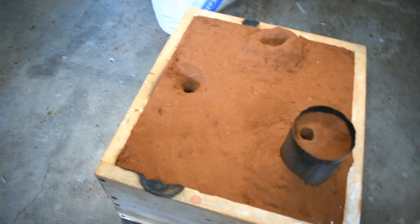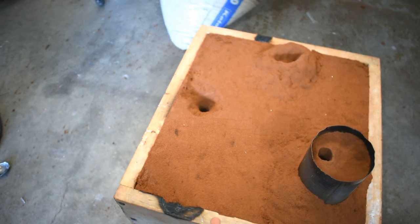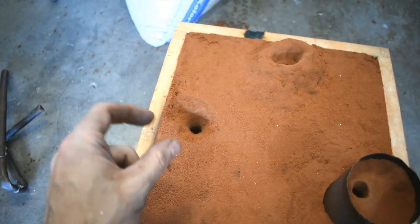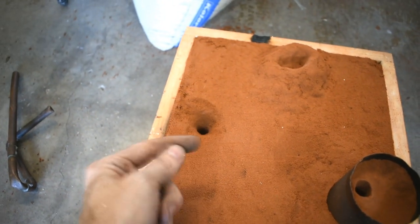The camera shut off before you see me cut the feeder there — I used this pipe. The hole is a little bit bigger than the part underneath, a little thicker. That way the feeder freezes last, so the feeder shrinks, not the part.